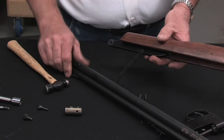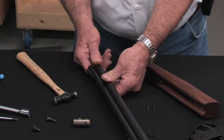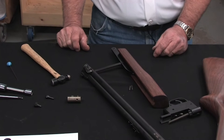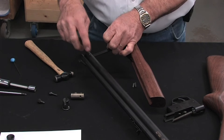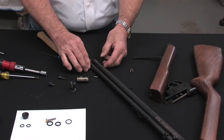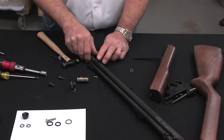At that time, you need to slide this rod up to the first hole. You might have to tap it a few times. There is actually a cap in the end of that barrel — that cap must come out; it fits in the end of your bottom barrel. When you get that out, slide this rod back to the second hole. There is a little pin in there that holds this assembly in. Knock that pin out and pull the handle out. Basically what we're getting to is the plunger, which will be this piece in your kit. Pull this rod out — this is what it looks like.